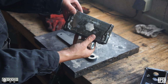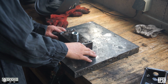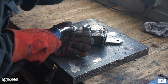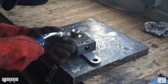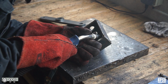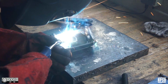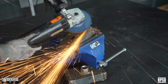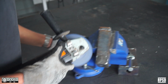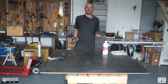Next, you're going to take the M20 bar stud and position it roughly in the middle of the C-beam that has the hexagonal hole cut inside. Once it's aligned, you can weld it in place. Clean all the beams with degreaser and then apply a layer of metal paint.